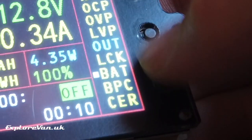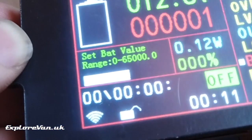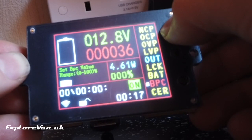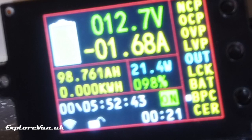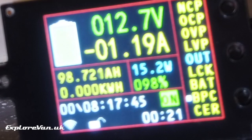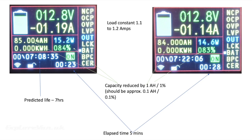The first setup action is to set the battery capacity. We have it connected to one 100 ampere-hour battery, so we set the capacity to that, and since the battery is freshly charged we tell the monitor it's at 100%. Watching the monitor we can see ampere hours ticking away. However, we notice two issues: there's no temperature reading despite it being shown on the product page, and the ampere hours were ticking away surprisingly fast — with the predicted battery life of only seven hours, which seemed far too short.